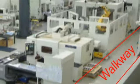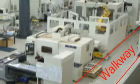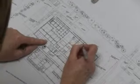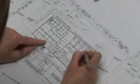The object is to assess the risk to personnel, so don't bother with walkways or areas where no one works. The measurement results should be marked up on an up-to-date factory floor plan. Consider segregating areas into hearing protection zones if this is appropriate. Ensure the drawings, and therefore areas of the factory, are marked accordingly.